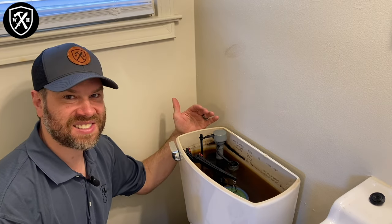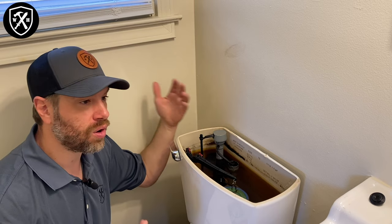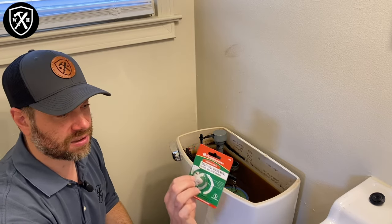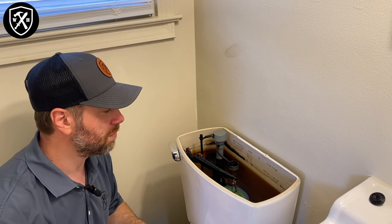Give it a little test — you can hear the water still running, then it lets off and we're good. Warriors, it's really that simple. A lot of these fill valves are the most common ones you'll encounter — American Standard and Fluid Master — and this Fluid Master fill valve seal is widely used across many different model numbers. Congratulations, you just saved yourself from a big fat water bill. We'll see you in the next video — make sure to click like, subscribe, and share this video with anybody who has a leaky toilet.